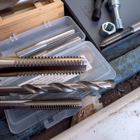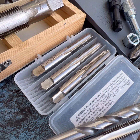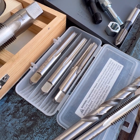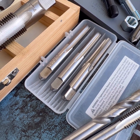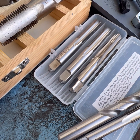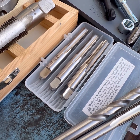These are decent quality taps — they come from McMaster-Carr. And if nobody's noticed yet, that little set in the plastic case is a special set. Those are 3/8-16, like the others, but they are actually left-hand thread, which I keep in a special spot. Say I have a big bolt that seized up in a hole or broke off — I'll drill it out, put that left-hand tap in there, and thread a 3/8 bolt into whatever is left inside, backwards, then torque on it like crazy to try and back the stub out. Ninety-nine percent of the time if you do it right, it works perfect. It's also not a bad idea to have a set of left-handed drills — a lot of times on smaller bolts it'll back them right out once they catch.